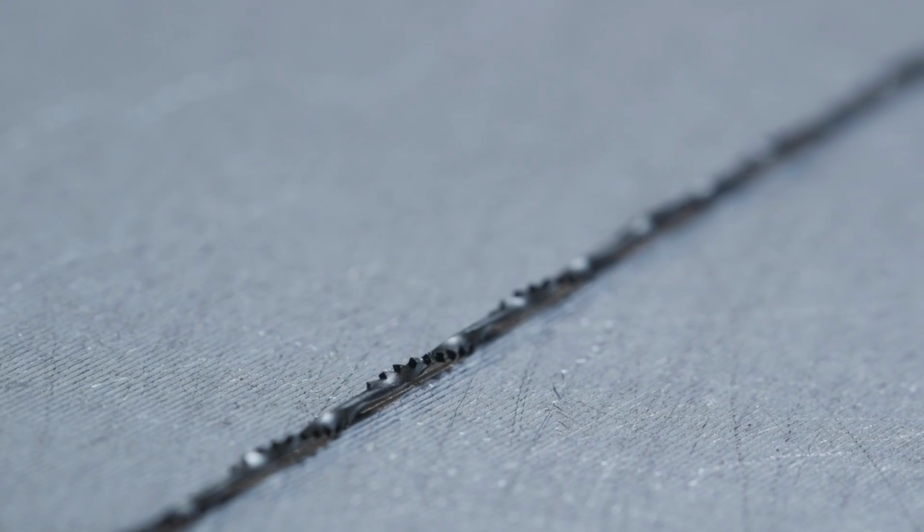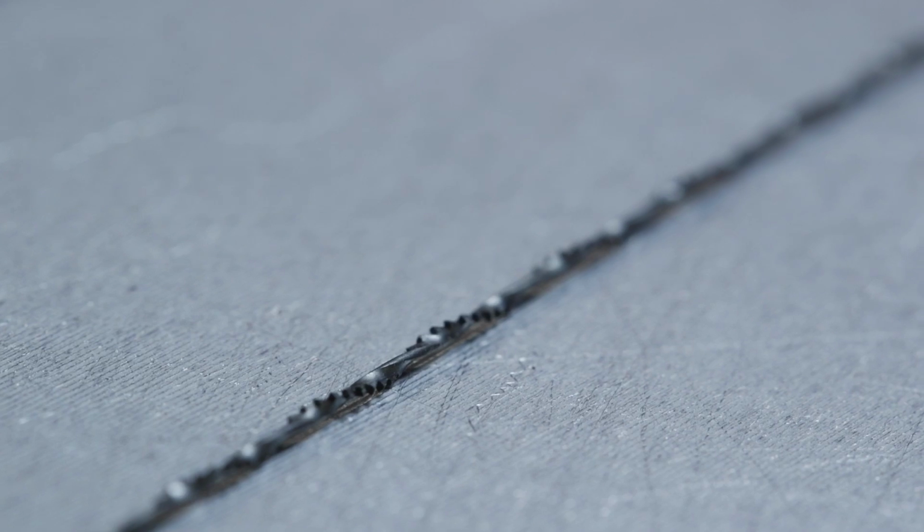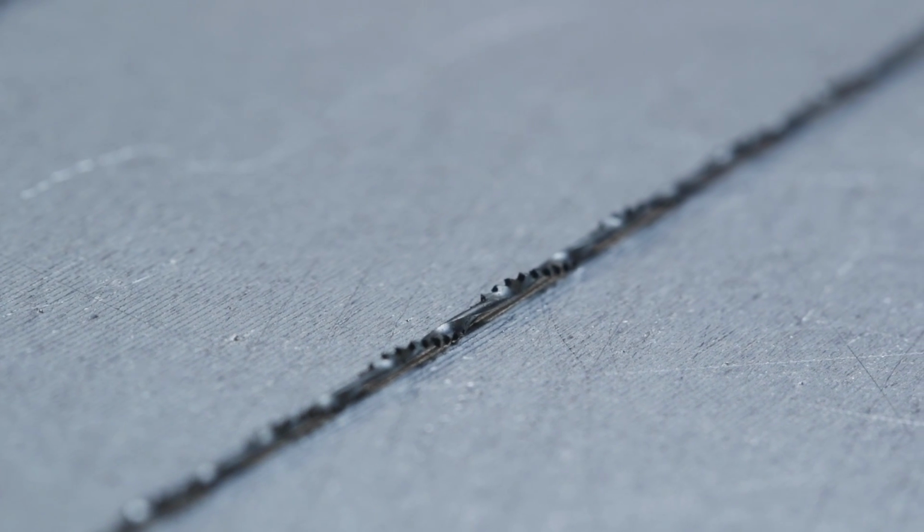Well, what about the spiral blades, those that can cut in any direction? I've never been a fan of those. I find it's hard to have a reference with those. You're kind of going willy-nilly. With the standard reverse tooth, you have the side of the blade that's not a cutting edge that you can kind of ride along to get a nice smooth line. The spiral blades are, even if you twitch wrong, it's going that way no matter what.